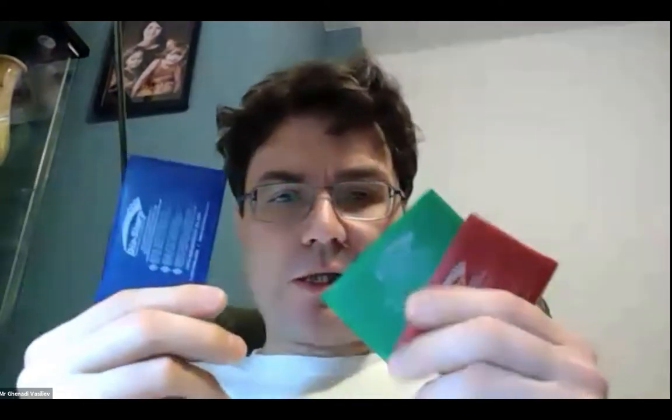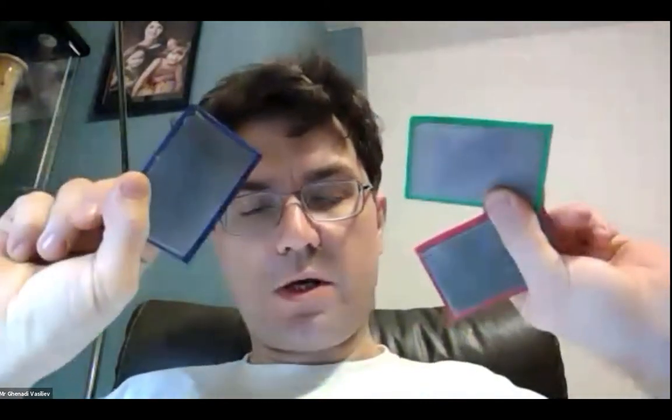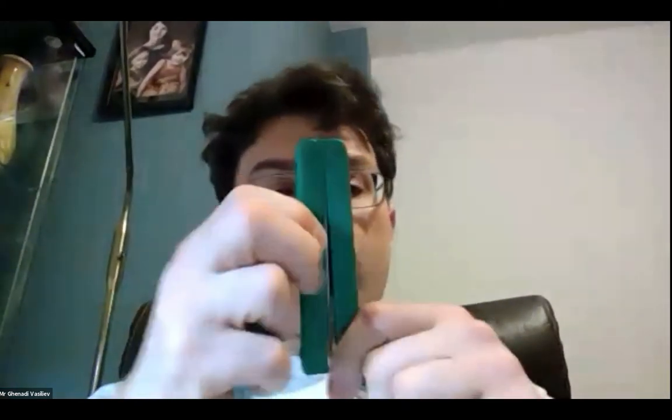So I shape my tools and do first sharpening on CBN wheels. With hindsight, I would probably buy a ruby wheel. I agree with Terry on this, but because I already own CBN wheels, I use them. I use not Trend, but DMT diamond credit cards. DMT is an American company, and arguably they produce the best diamond honing stock in the world. They take pictures under a microscope and show you this and that, but yes, they have a huge range of tools that they produce.